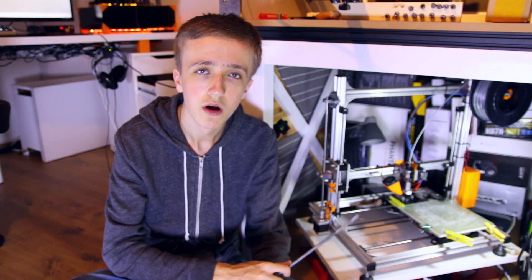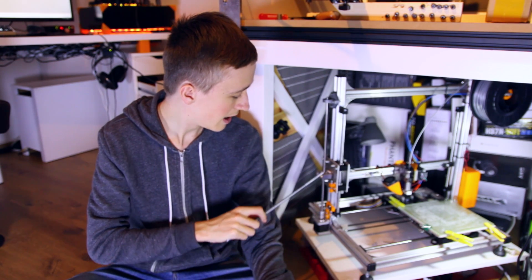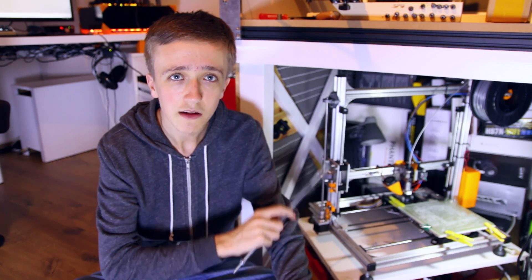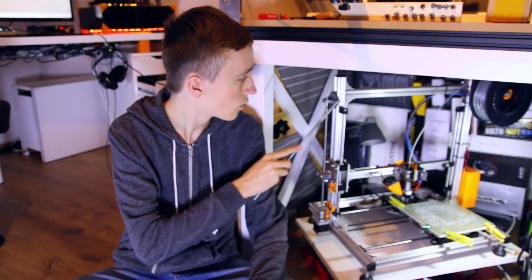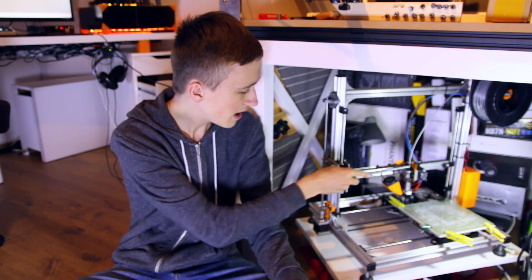To correct that, I just bought an 8mm lead screw from AliExpress, which came with two bearings, a coupling for the motor, and the nut that drives my arm right here. As it is really similar to what I had before, I only had to print two adapter brackets — one up here to connect the bearing to my extrusion, and the other down here to connect the nut with my arm.